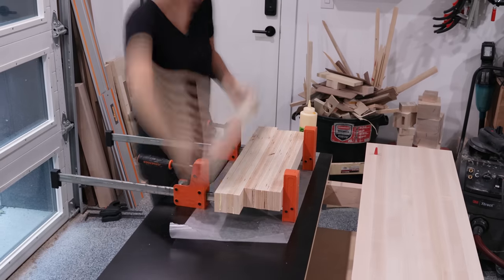The template also has tapped holes where you put bolts in place and they act as an edge guide. Using the bolts as an edge guide I move the template along and use the etched center lines to mark off where all the holes are going to be. Now that I know exactly where the holes will end up I can figure out the length of the pieces that need to go between those wider supports. I did a few test cuts until I got the perfect fit, then cut the rest to size at the miter saw.